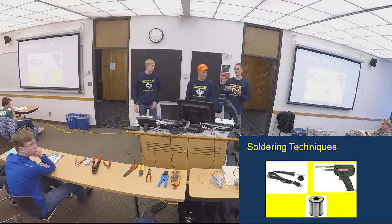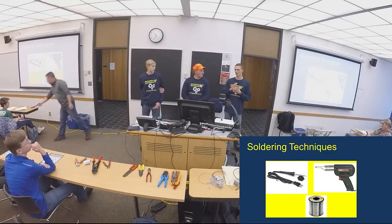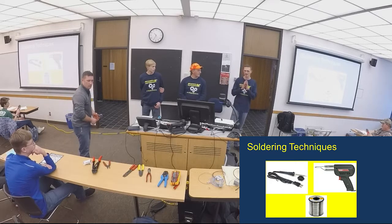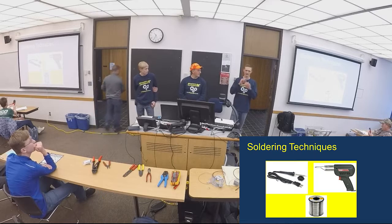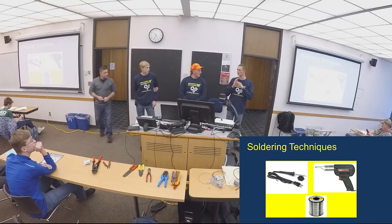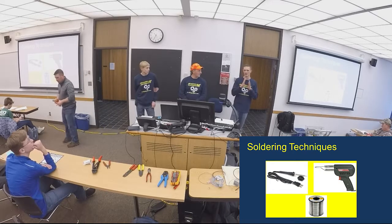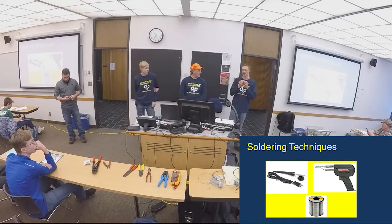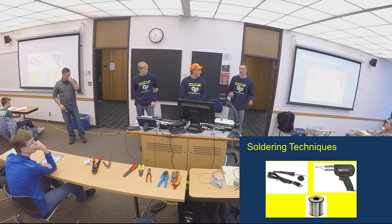One thing that's important about those connectors is that you strip the wires to the right length. I was showing someone this last night, and he did it, and it clicked, like Travis was talking about, but it didn't actually latch over that piece. If you leave too much wire hanging out, it'll butt into that plastic piece, and it won't make it to the point where it latches all the way over that other metal piece. That's what will cause it to just fall right out.